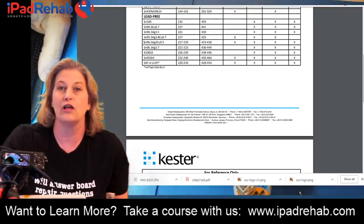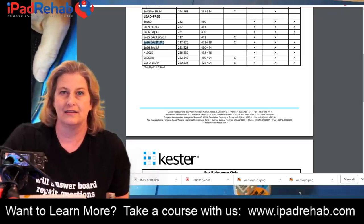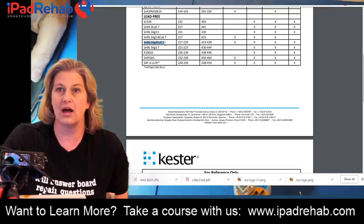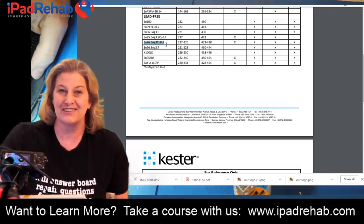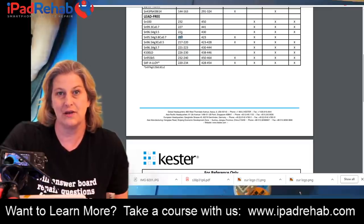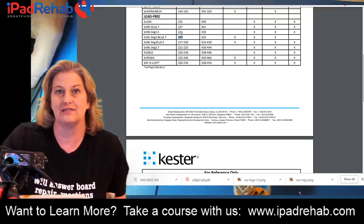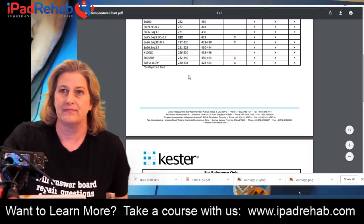After a lot of debate, the bismuth solders were candidates but were voted down — they were not chosen as the new solder. What was voted in is SAC — the tin-silver-copper conglomerate — that's what's in the iPhone and most consumer electronics. It's good, but not as good as leaded solder; a little more brittle, and the big drag is you have to get it seriously hot — 217°C melting temperature — meaning you need to work up around 280°C.